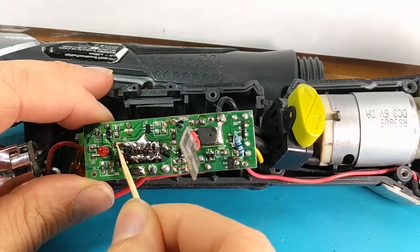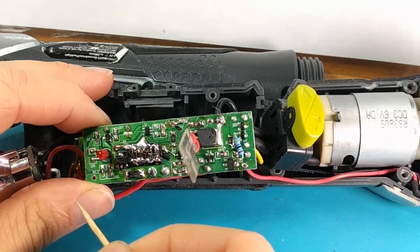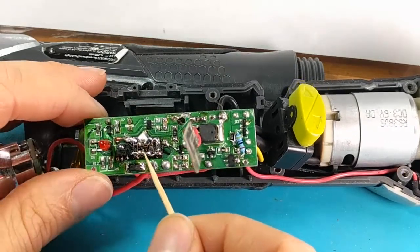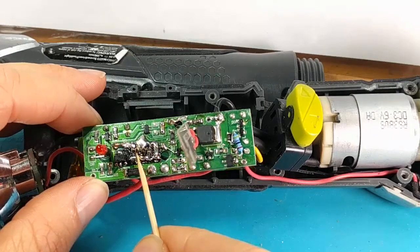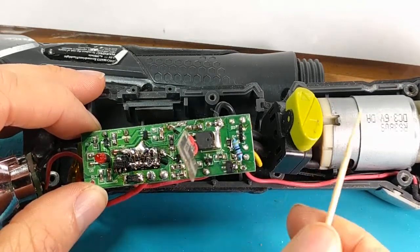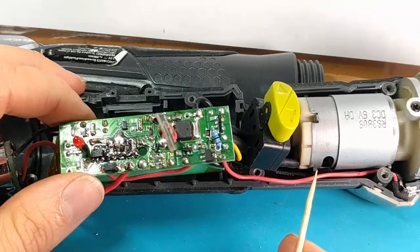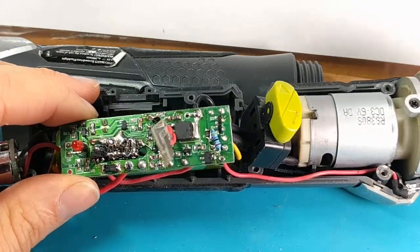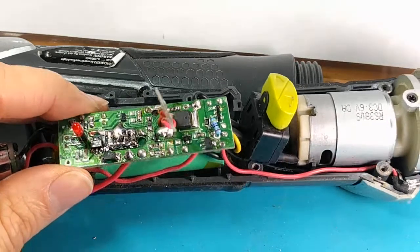There's a diode up here which switches on what I'm sure is a PNP or NPN to switch on this LED when it is charging. This charging circuit is the one thing I didn't really investigate too much. But it's pretty cool that this very small, mostly very simple board is a lithium-ion battery charger, a discharge protection control circuit for the lithium-ion battery, a discharge protection circuit for the motor, and an LED output when the motor is driven — no matter if it's forward or reverse — and a switchable high-powered LED output, with current protection. Really impressive for such a small, low-cost board.